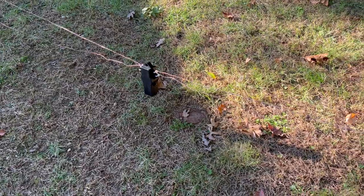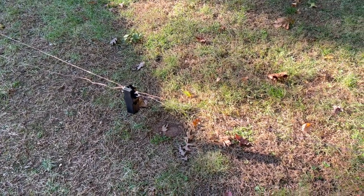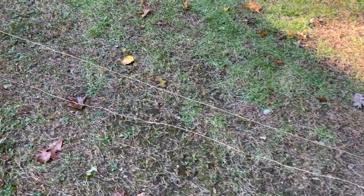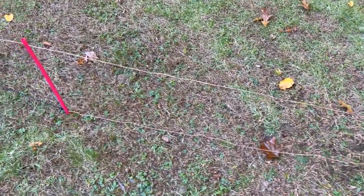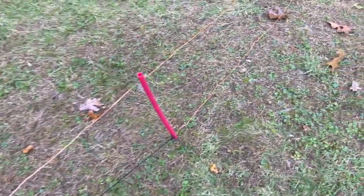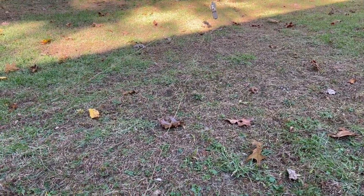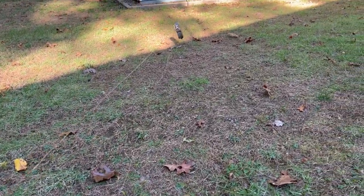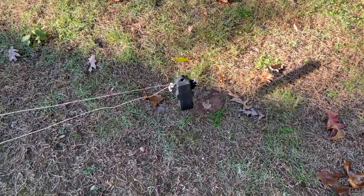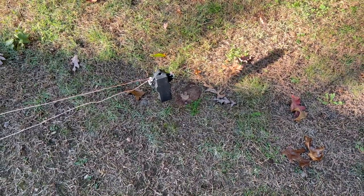I strung the antenna up just to get things unraveled. Note to self: using this kind of wire is like working with a slinky sometimes, but I got it all apart. The first thing I noticed was that the bottom antenna was very loose, because the PEX line is not very rigidly in place on the supporting wire. So I added a little bit of antenna cord to put some tension on the bottom radial. I think with the coax cable hanging in the center, that should hold things pretty sturdy. Next thing is to put the coax on it and string it up a little higher.